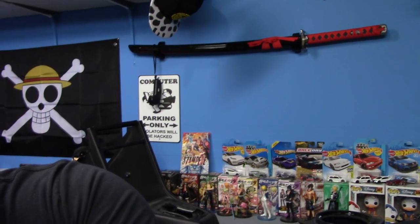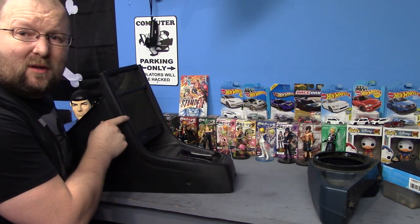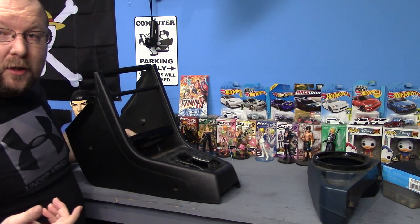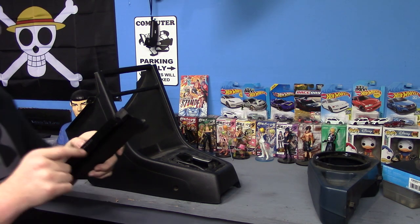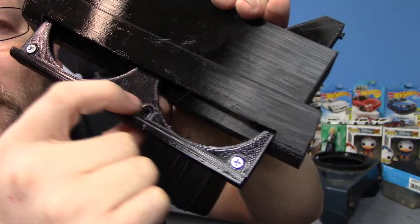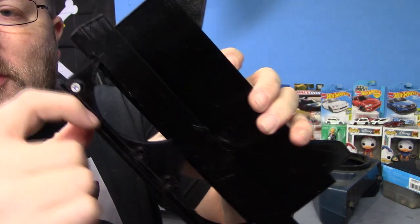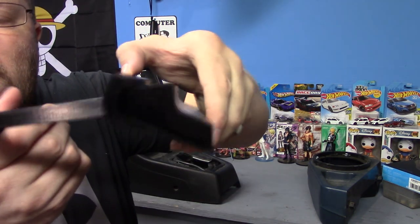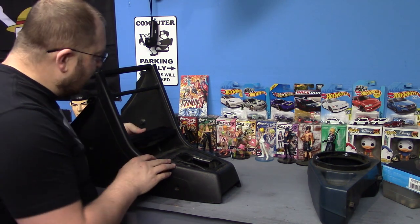I'm going to move my camera down here just a bit so you guys can kind of see how this looks. So it's going to sit in here just like so. I didn't want to print a whole piece because the big piece takes about 30 hours to print. This front piece actually has to be screwed in — there will be four screws along the bottom — or I might glue it. If you ever have to pull this piece out, it's got a lip here on the bottom to stop it, and I also have stoppers so when it comes out it stops and doesn't move. So it has to actually be put together as two pieces.